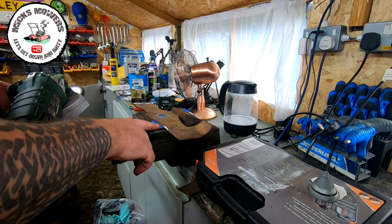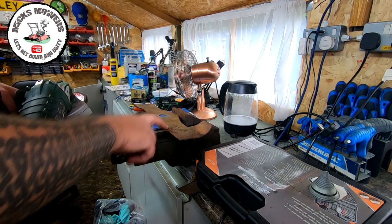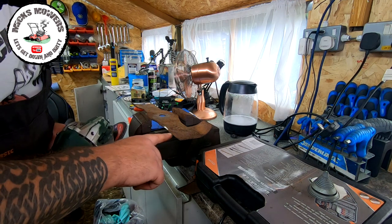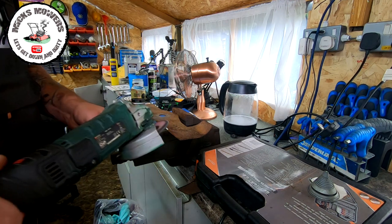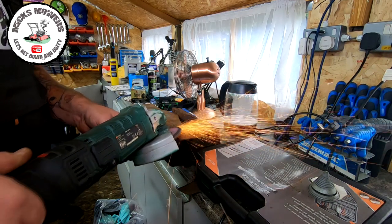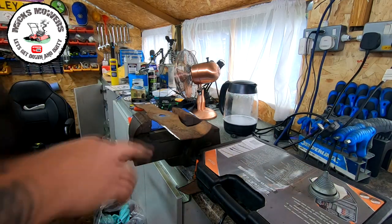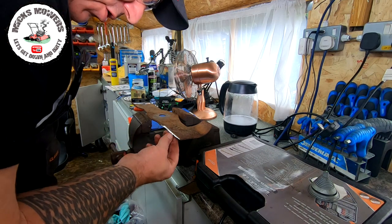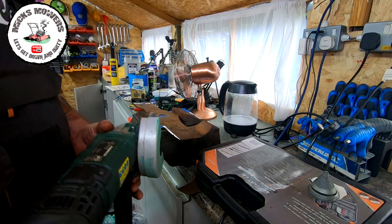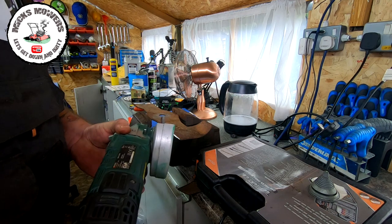You can see there — because I do this quite a lot — I'm already on the money. I've got a nice even wear line, not on the edge, not on the top. Nice even wear line, so I know my angle and now I'm just going to repeat that process to bring this down to this nick. I've got a complete edge there now, however there is this rather large nick. So I tip the grinder on its side and grind the rest of this profile down to the lowest point of that nick.